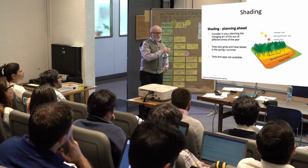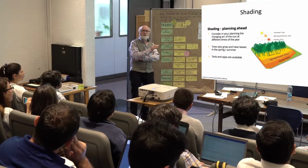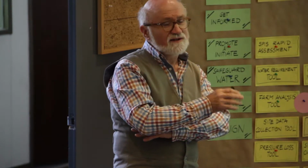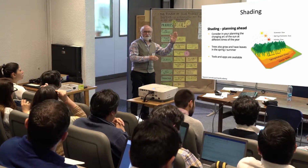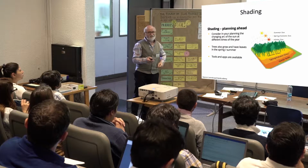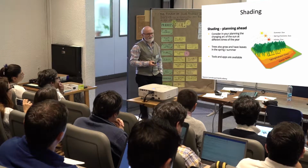A few months ago I was in Kenya, and I visited a farmer, and he said the solar pump is very nice, but at 2 o'clock it always stops. So I said, let's look. After 2 o'clock, the sun was shaded by trees, so it was very clear that it was not installed correctly. And he thought it was a problem with the pump or whatever, but it was very easy.